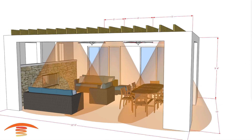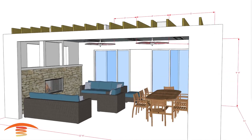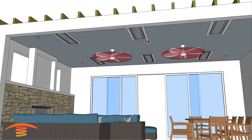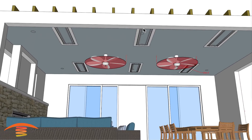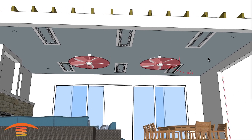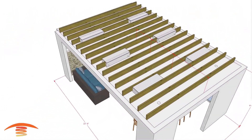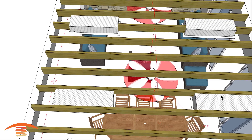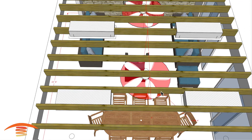The next option would be placing some additional units — 4,000-watt dual units in a recessed or flush mount system. You can see here I have six total. Something like this covers up the lights right here, so that might be one issue. But I'm going to turn off the top view so you can see what other issues we might have. We need to make sure we'll actually be able to place the heater between the ceiling joists.